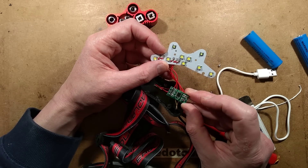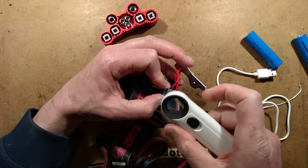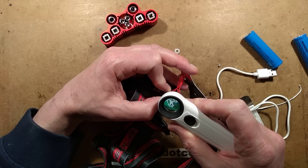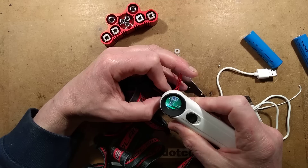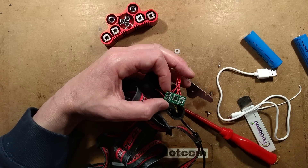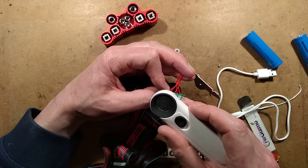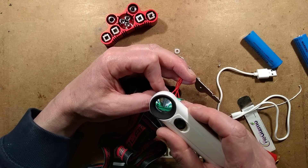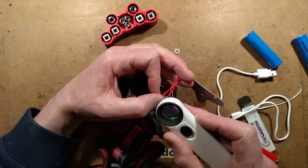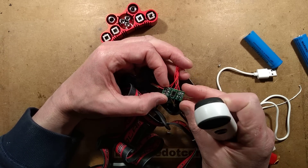It's got four transistors. The chip might have a number on it — the chip does not have a number on it that I can see here, tilting at various angles. Nothing on that chip; it's anonymous. It's one of those vague little microcontroller chips. As for the transistors — A2SHB. A2SHB little MOSFETs, if I'm not mistaken. Yes, it is an A2SHB.